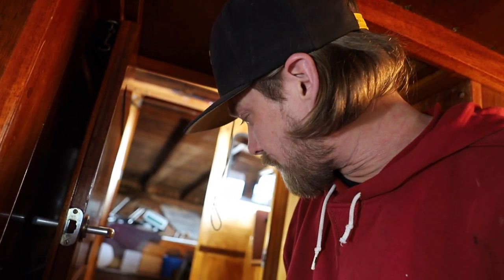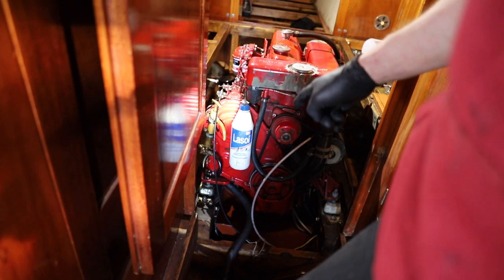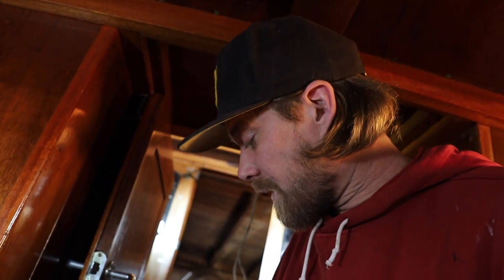one more thing I need to do before I try to start the engine is that I'm gonna get some water, because I just changed the impeller for the water pump, and you cannot run it dry. So there's the intake hose for the pump. I need to put it in a bucket full of water, and so when I start, it immediately gets some water in and it starts pumping the water. So I only can keep the engine on for the time that I have water in the bucket, and the pump is quite powerful. So it takes something like 15 seconds, 20 seconds before the 10-liter bucket is empty. But I'm gonna get the water, and then we try to start the engine.